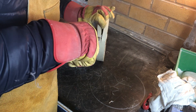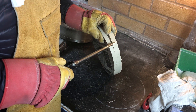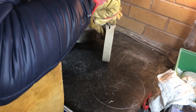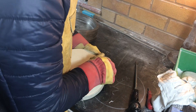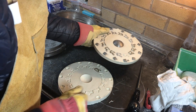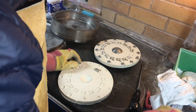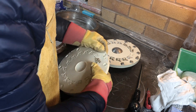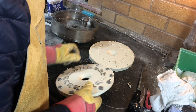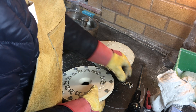I'm showing you the gradual way of doing it, so you gradually take it apart from the parting line. You can see where one of the V-notches was in the top, and the bottom rubber has come up slightly as it all formed — it actually helps lock the mold together. That nut is obviously too close to the edge, so you need to leave a gap. We're just going to pull that apart and there we have the mold — a random sword, arm, and horse mold — and then we'll slightly pop out the originals, bang the nut out, the mushroom even.